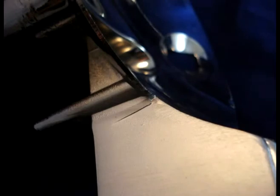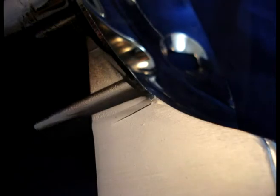The import brand again has large imperfections from grinding, and note the almost cut-like line that tries to mimic the original casting. Looking at the USA made grill bar, the correct cast-in step and clean crisp lines prove that the quality really is in the details.